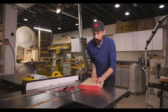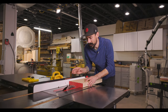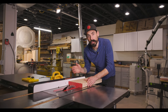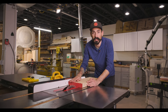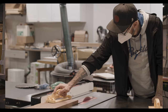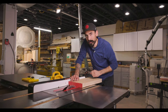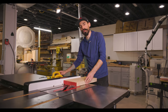If I'm going to make a cut and I need to remove several inches off the waste side of a board, I'm not going to cut that on the table saw first. I'll go to the band saw, get it within a quarter of an inch, then do the final cut on the table saw. This keeps you much safer — the chances of a quarter inch or eighth inch of waste pinching the blade hard enough to kick back? Probably not going to happen.